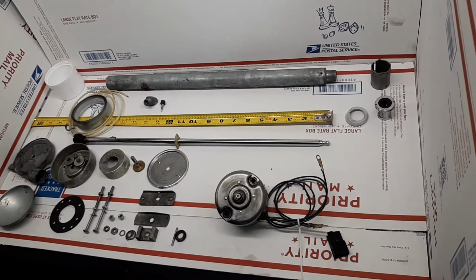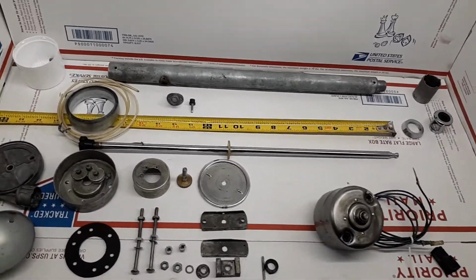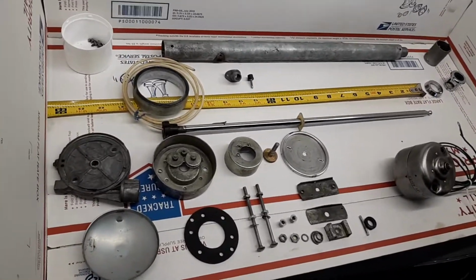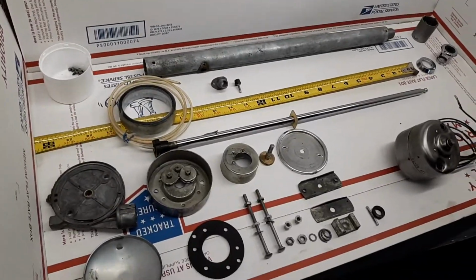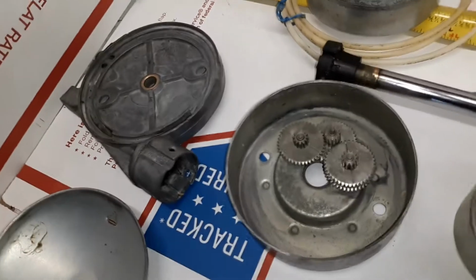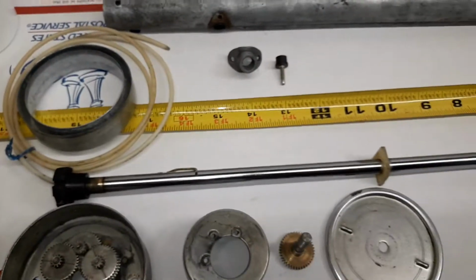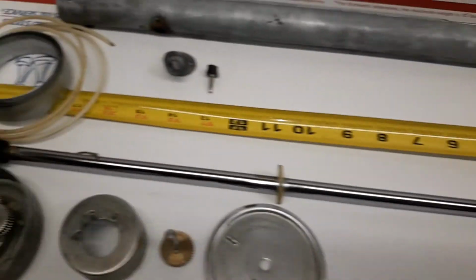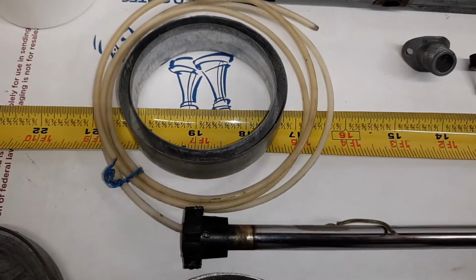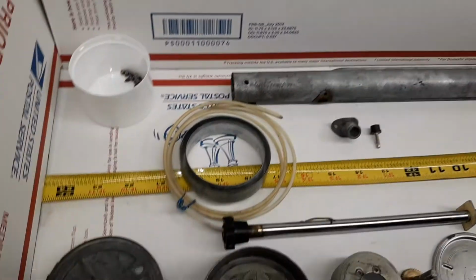This is the original vintage 1959-1960 Cadillac power antenna mechanism. I've done a complete disassembly, all the way down to the final gear and final screws, and I'm doing a full restoration of this unit. The 5-gear multi-pinion gearbox, the 19-inch beautiful telescopic mast, 19 inches overall length, and the 18-inch tubular body, as well